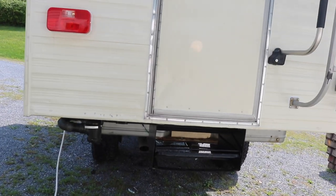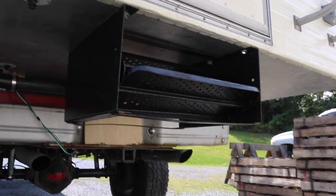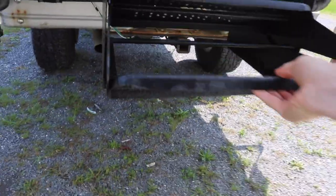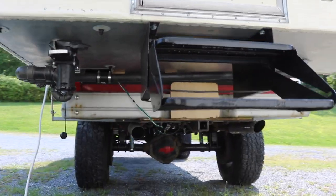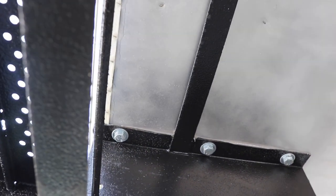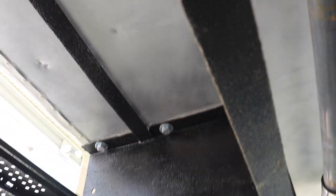Here's the final — well, it's never final — but we have the steps on there. Let me pull them out for you. Got them temporarily on with some galvanized half-inch lag bolts — big boys, don't want it going anywhere. I'm going to change those to stainless so they stay rust-free, but for now I can only get galvanized or zinc coated.